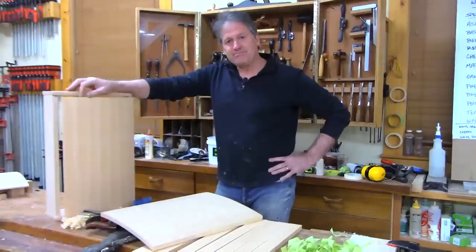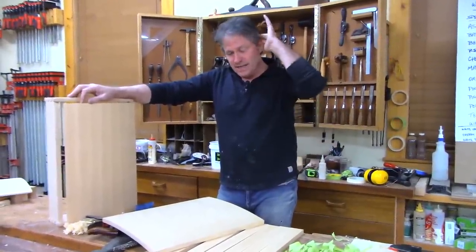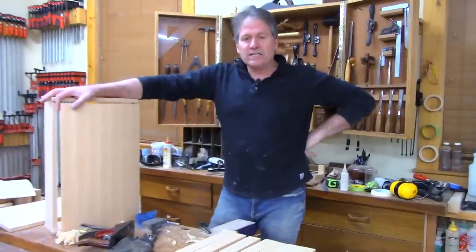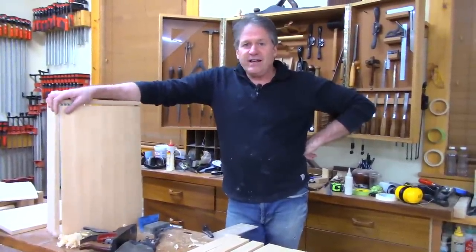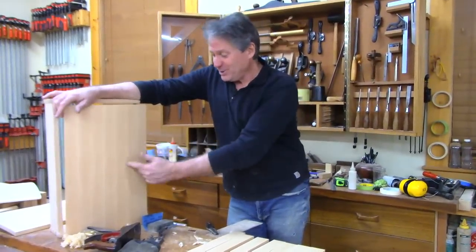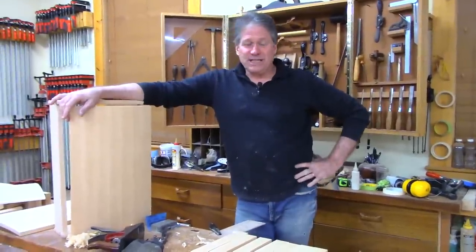Did they use white oak staves, like on whiskey barrels? Yes, white oak was commonly used. You couldn't use red because it was too porous, but the white holds it. Then they would char it, and once the liquid goes in, the wood swells and really seals all those tight miter joints. So they're already pretty tight, but they're leak-proof once you put the liquid in there.